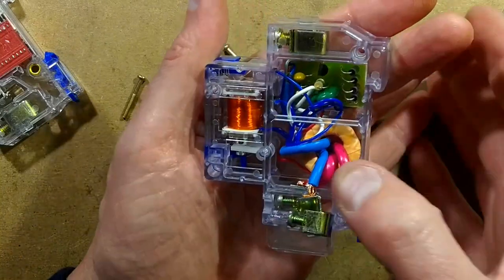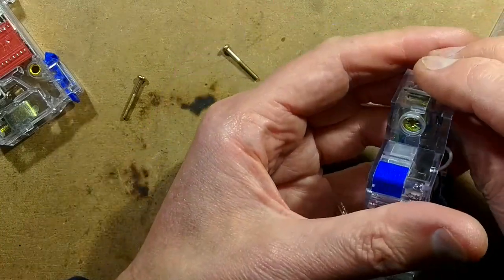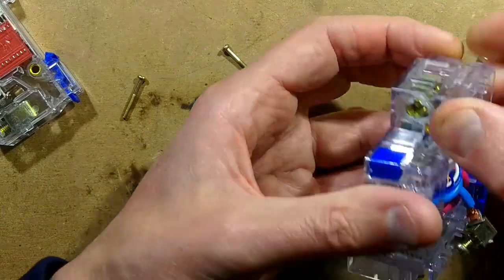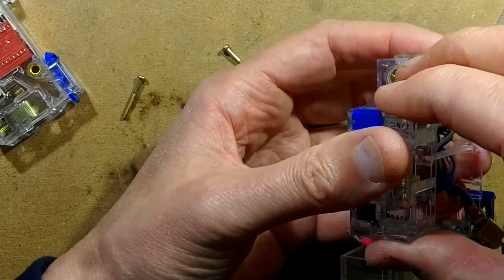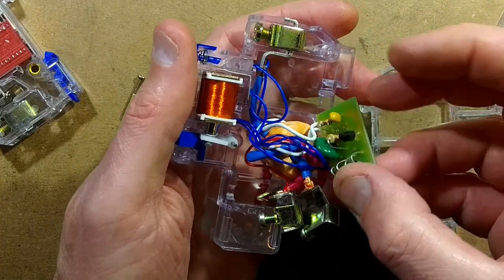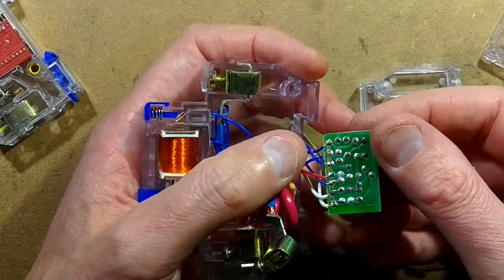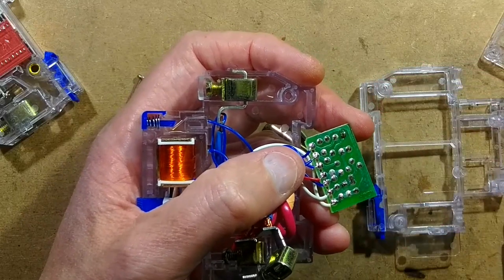I'm very intrigued by this circuitry — is it a dedicated three-pin chip doing all this? The way this senses fault current: it's got windings going through a toroidal core, and the current flows out through one wire and back through the other. Each is wound so that if the currents are equal the load is normal and they cancel any magnetic field in the toroidal transformer. If there's an imbalance, it induces magnetic flow in the toroidal transformer, which is picked up by this little sense coil with the two white wires and triggers the mechanism.